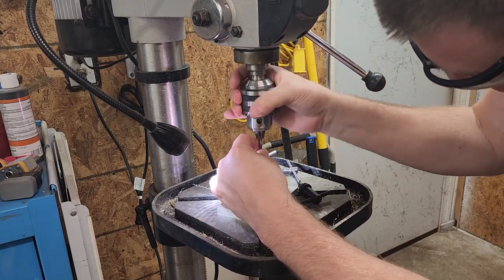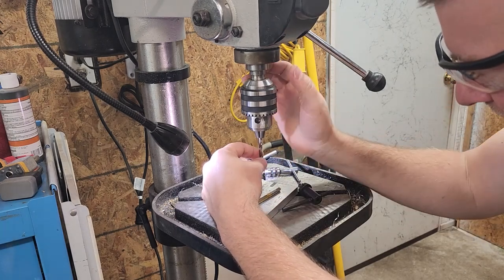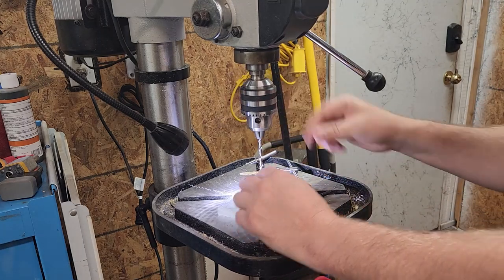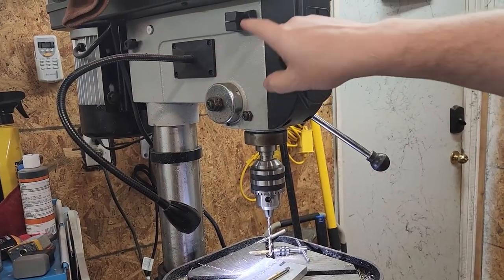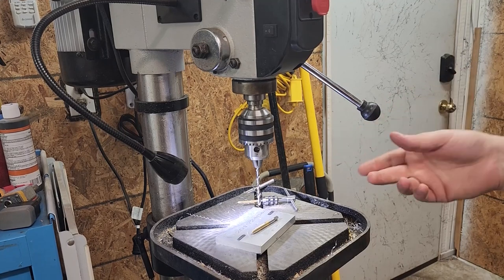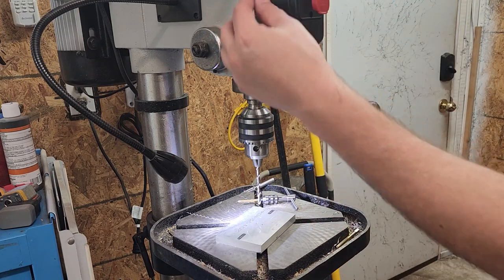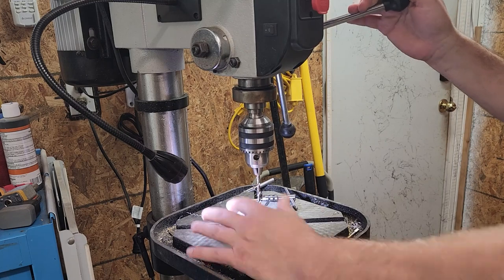When putting a drill bit into a drill press, open the chuck wide enough so you're not dragging the bit, then wiggle it while tightening down. You want to put the shank as far up into the chuck as possible, right up to the flutes on the drill bit, then tighten it down. Up here on my drill press I have a holder for my chuck key — it's spring loaded, which prevents it from sticking in the chuck. If the chuck key is stuck in the chuck and you flip the machine on, you've got a projectile. Very dangerous, so always have a designated spot for your chuck key.